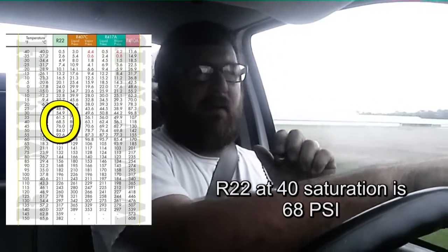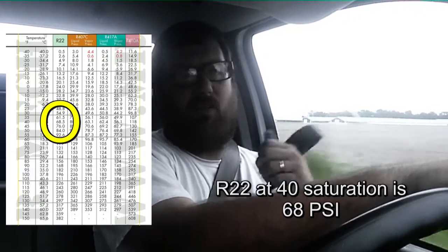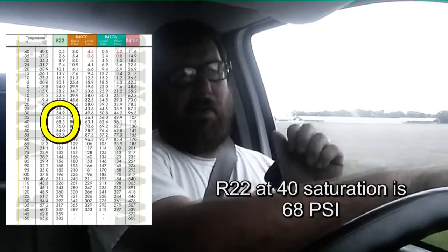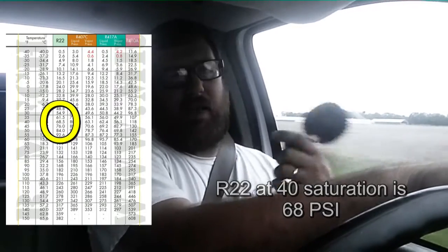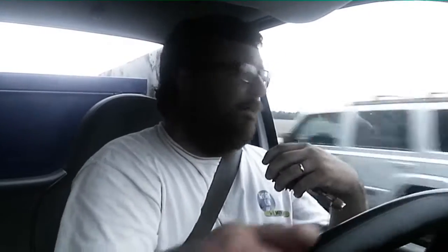The only difficulty is making sure you realize you're dealing with a high efficiency evaporator. Usually what I do is just check what nominal tonnage it is — there's not going to be a stamp on the outside saying 'oversized high efficiency evaporator' because it's different for every matchup. I would just check if the tonnage is higher than the condenser or heat pump you're dealing with.